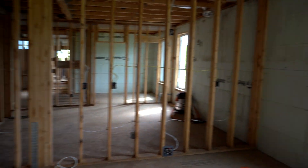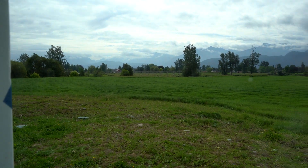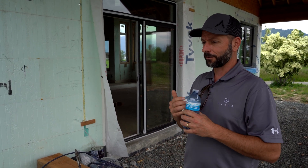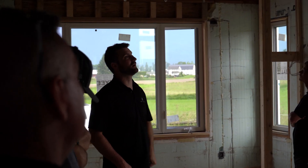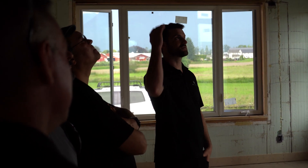Above grade, it's definitely more expensive, and that gets a little more difficult to answer because it's so home-specific. The simpler the home layout and style, the lower the increase in cost is going to be. There's no such thing as a square foot number that works for everything — it comes down to details. On this particular home, which is reasonably simple and straightforward, it's approximately 5% to 7% more than conventional construction as far as an overall construction budget.